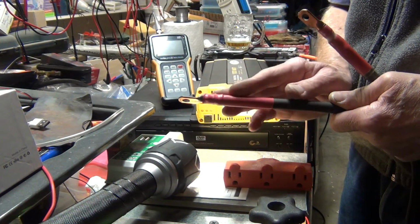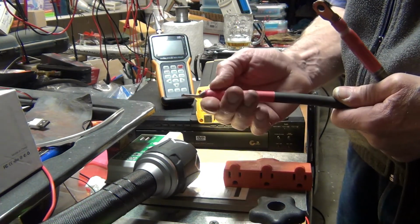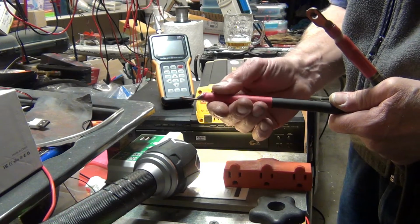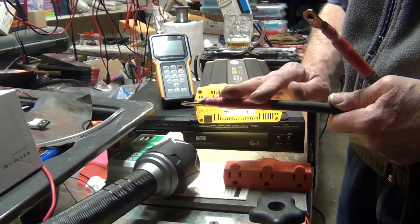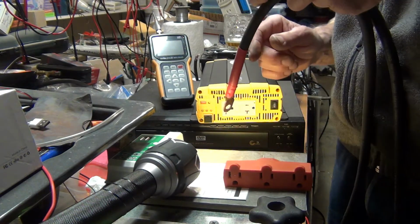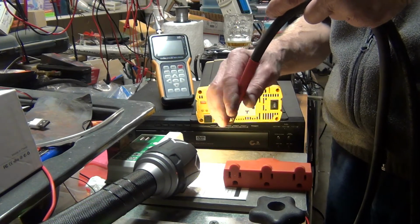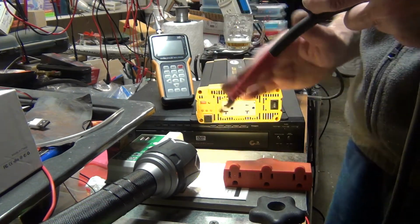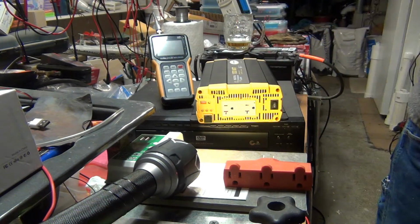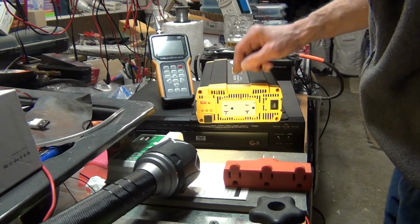I actually solder these connections. That's the best thing you can do. Don't even bother crimping these things. Just push it in and solder it. Just tilt it this way and fill this with the solder pretty much, when you're soldering these. That's the best connection you can do for your solar system. But let's go back to this puppy here.